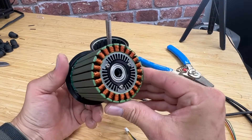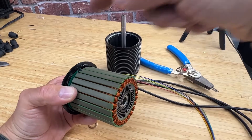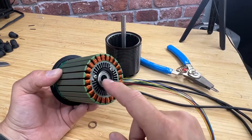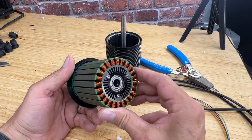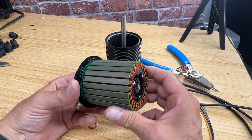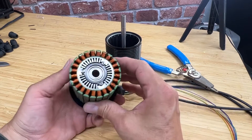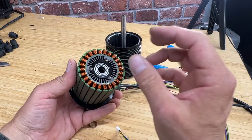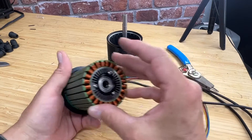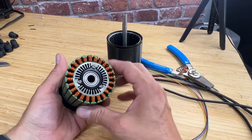Most outrunners, even ones that have centrifugal fans like this, usually have the air running along the outside of the stator. The center's filled in and there's no way to get the heat building up in the center out, so you get thermal throttling much sooner. In this case, the air is pulled through the core and is also allowed to go around the outside of the stator, and that keeps it much cooler than it normally would be in a comparable size motor.